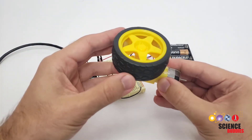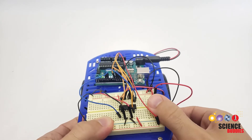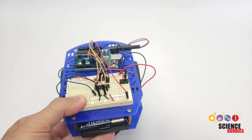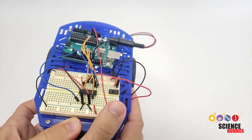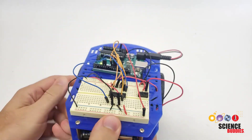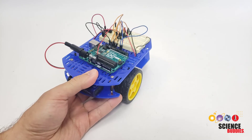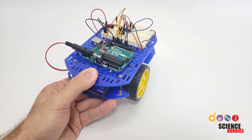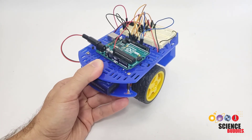You may remember from a previous video that when I turned this robot on and called the drive-forward function with both wheels at full speed, it doesn't go perfectly straight — it kind of drifted off to one side. Both my wheels are spinning full speed, and you can see it drifts to the right. That means there's a little more friction on the right side or the right motor is spinning a little slower. If the left motor spins faster than the right motor, that causes the robot to turn to the right. So if I want to get it to drive perfectly straight, I can use the analog write command to slow my left motor down. Pause the video here, edit your program so you control the speed of both motors independently using the analog write command, then upload it and actually test it out. Put your vehicle down, let it drive, see if it's drifting to one side, and then adjust the speeds of the motors to get it to drive straight.